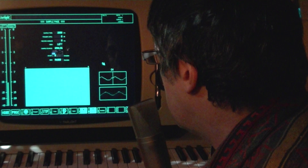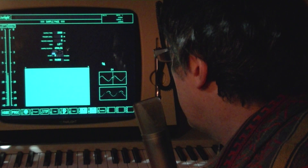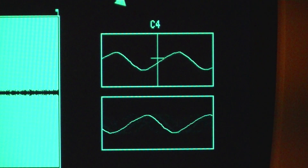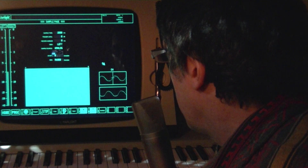You then adjust the pitch until the oscilloscope shows exactly two cycles. When the pitch is about right, the zero crossing will fall on the crosshair. The tuning indicator — the lower of the two boxes — works like a strobe tuner where the waveform becomes stationary when it's exactly at the right pitch.